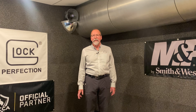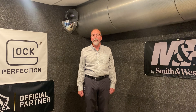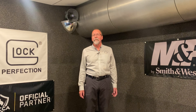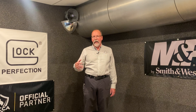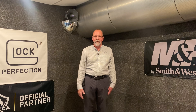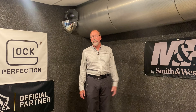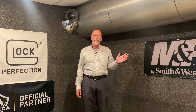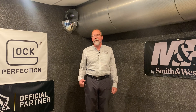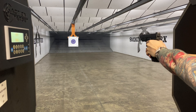The first part of the range we're going to discuss is the ventilation system. It's a purge ventilation system, meaning that it's pressurized behind the shooter and then the air is vacuumed out on the other end of the range. The air comes in through a contraption called the diffuser. It's pumped in and actually blows from behind the shooter downrange, so you never smell the gunpowder and never have to breathe in any dust of any kind.